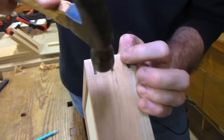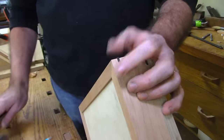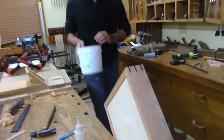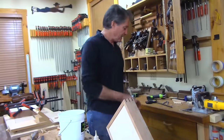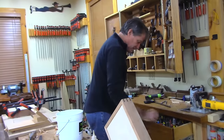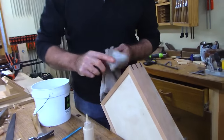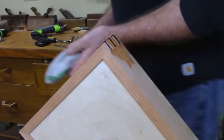Ebony is a nice material. The main thing here is just make sure it's fully seated. Once they're in there a couple minutes, they're pretty solid. So you think the middle one was tight because of the glue? I think if you let the glue really dry first you'd get more uniformity when fitting them in. I'm going to clean off a little of the glue and then grab my block plane — we are going to flush these up.